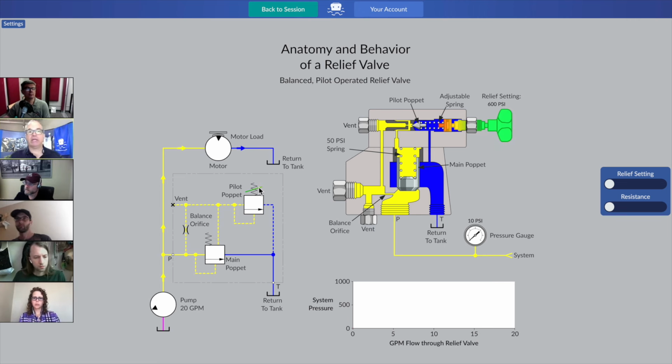And so what have you observed? It's a little bit more complicated looking. I promised you a relief valve that has 2 poppets and 2 springs, and I think you could see them. There's a main poppet here, the P port coming in from the system, the pump, and there's a spring. There's those little 2 rows of circles. And hang on, what's with that spring there? That spring says it's only 50 psi. That doesn't sound like a very strong spring.